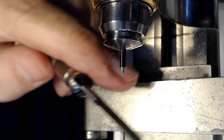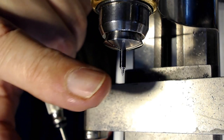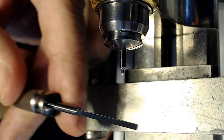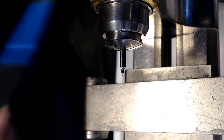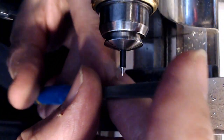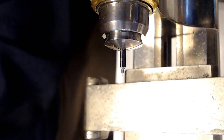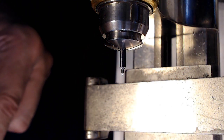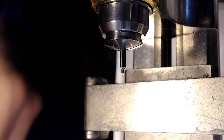Now you don't want to do too much with your graver on the end when you're working on the pivot, because if you do, you're likely to push the graver forward and just snap the pivot off. It just doesn't work that way. So when I get close here, I can actually use the pivot file. You should put a little oil on the pivot file too. So if I can just find that. I think I said something about using it the other way, but you always use it from underneath because you can't see the friggin' part if you don't.